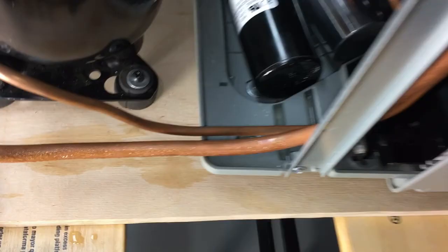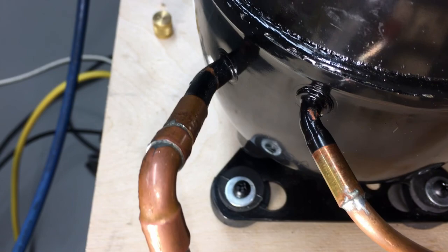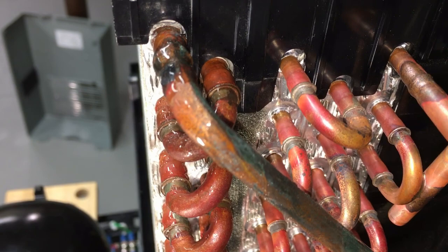There's a little bit of sweating back now but it just starts to stop as it goes into the compressor, so I've probably got a little bit too much charge in it — but for now I think we'll leave it. It's still not real warm or real humid down here. We'll leave it at that for now and see how the old Frankenstein runs for a while. Thanks for watching.